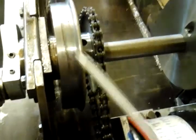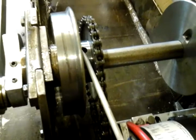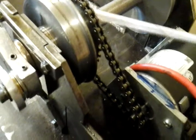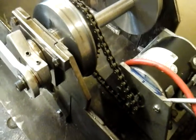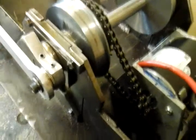On the sprocket on the motor — on the axle — there's a boss on the sprocket. I've pinned that sprocket straight through into the wheel with two grub screws, and then I've drilled a hole straight through the boss and right through the axle and put a split pin in to firmly secure that. So everything's firmly secured now. The axle and motor are giving me a three to one reduction, and going into all the calculations with the diameter of the wheels, speed of the motor, and reduction at the sprockets, that's going to give me about a top speed of eight miles per hour, which is adequate for the track I'll be going on.